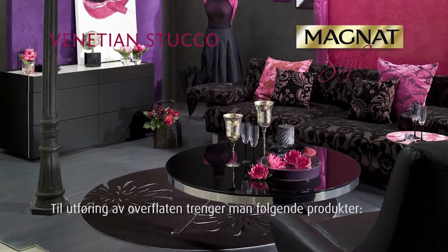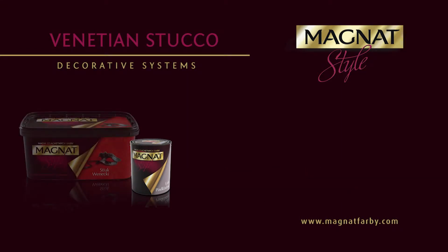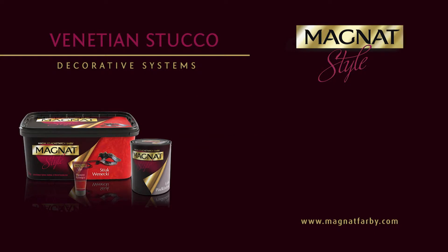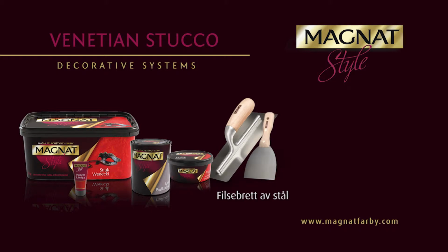Application of the coating requires the following products and tools: acrylic primer, a primer for optimum substrate preparation; Venetian stucco, a thin layer acrylic textured paint with a polished marble finish; coloring pigment, a concentrated pigment for coloring Magnat style products; impregnating and protective wax, a protective compound for the Venetian stucco surface which produces coats resistant to scrubbing and water washing and highlights colors; a steel float.